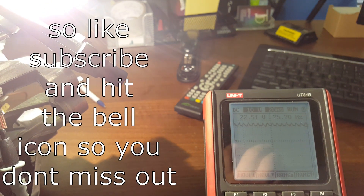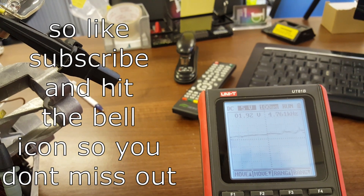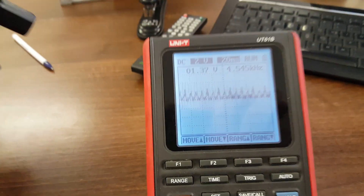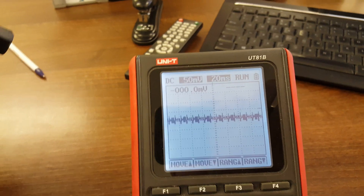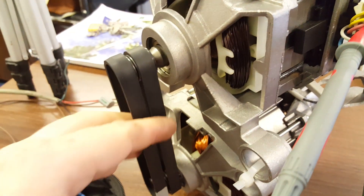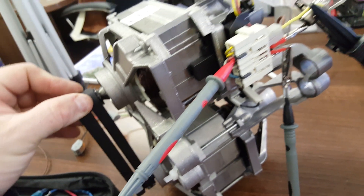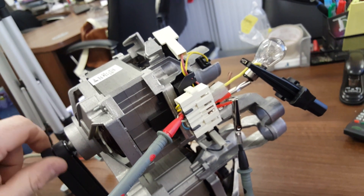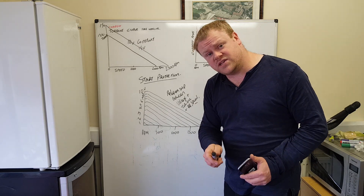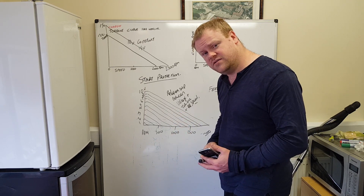The light bulb just popped - you could hear the amount of braking that happened when it did. Once it was allowed to freewheel you could hear the braking effect, and these motor casings are hot to touch, so you get a really good braking effect out of it. That's what we'll look into next week - we'll integrate regenerative braking into our PWM controller for DC brushed motors. Next week we'll actually build the controller, program all of this in, and see how it works. See you then!